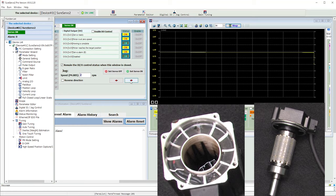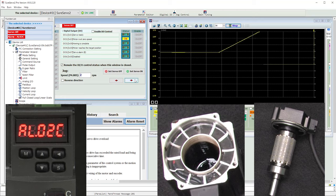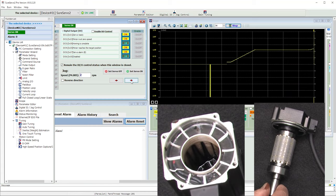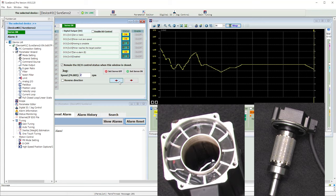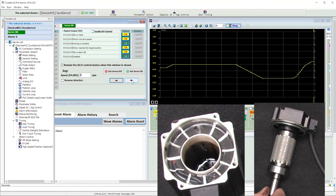The drive is going to keep pushing until it gets what it wants or it faults out. If I press jog to increase the current even more, eventually the drive faults out – the current drops to zero and the magnetic fields go away, and the drive gave us an overcurrent fault. Let's reset the fault and jog a bit to reestablish the magnetic field. If I gently rotate the rotor – really the encoder – in the direction the drive wants it to go, it's really touchy, so I'll finish it off by jogging to zero amps; we see the current reduce and the magnetic fields drop. If I jog in the other direction, we get the same magnetic fields but opposite polarity to move the rotor in the other direction. It's a shame we can't see the direction of the fields with the ferrofluid.